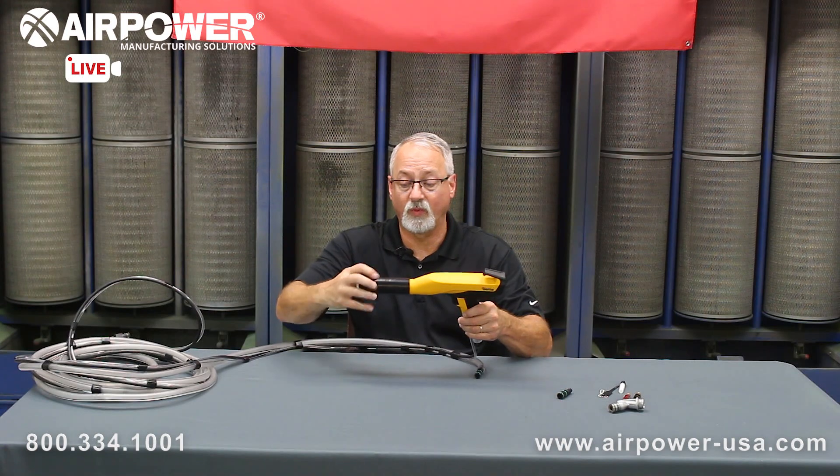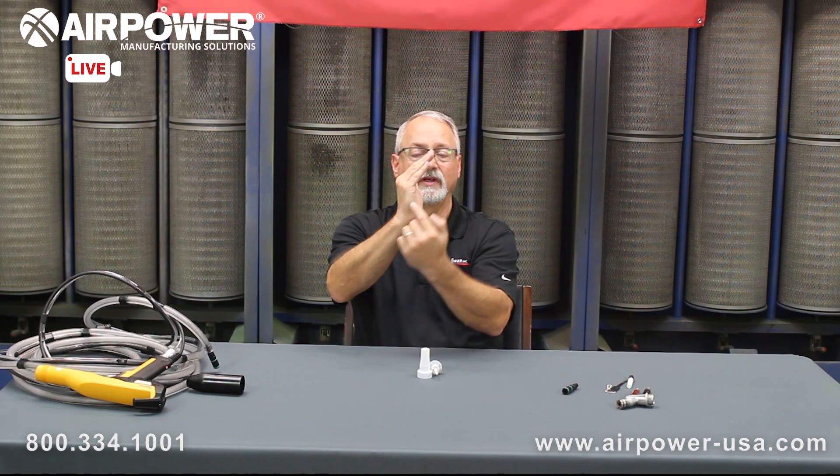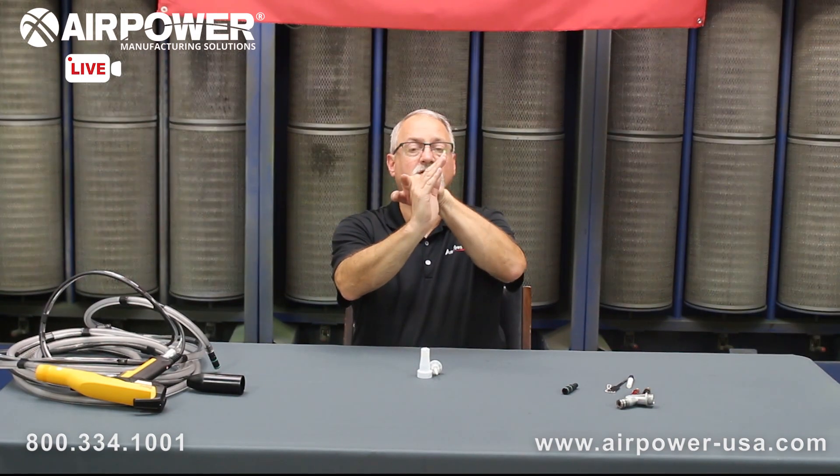The last thing to think about for wear items is your electrode and your nozzle. Once we remove the electrode holder from the gun and look inside, there is a splitter in there that splits the powder off — it's a shoulder at an angle. As that angle wears down close to the flat part, it shows you that it needs to be changed. So somewhere close to the end, you want to change the electrode holder so that the powder splits out and gives you a good even cloud.